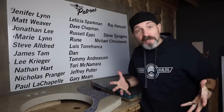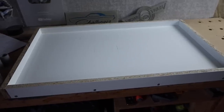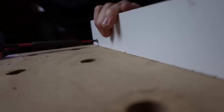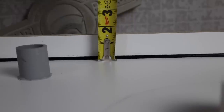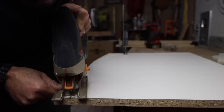Now let's talk about building the molds for these two bad boys. Both molds are made out of simple melamine boxes screwed together with one and a half inch screws. Mold number one is two inches deep, and mold number two was made at an inch and a half deep. Also with mold number two I did add a slight radius to the front to give it some visual appeal.